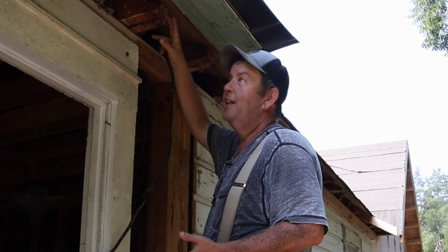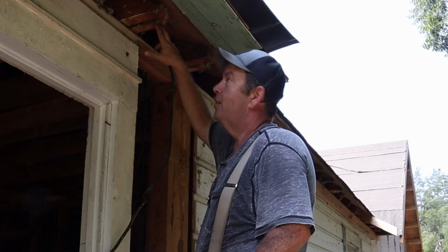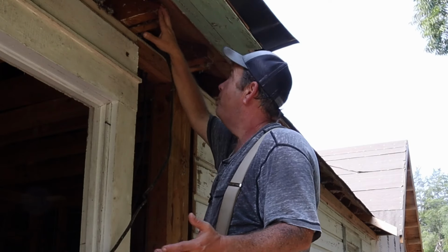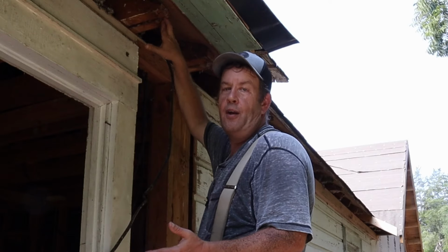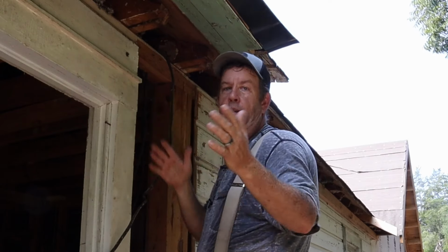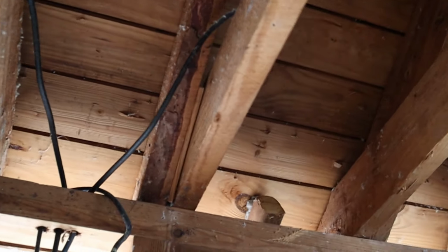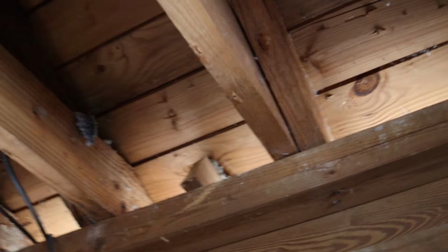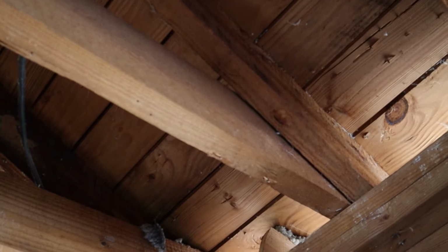That's gonna be tough because of what they did with these rafters. We've got a floor joist here, ceiling joist here, got a rafter here, and then they nailed them together where they meet at the end, that's standard. The thing is, all of the rafters aren't on the same side of the ceiling joists. They just put it on whatever side. Well, that makes it difficult to lay everything out exactly 16 inches on center.